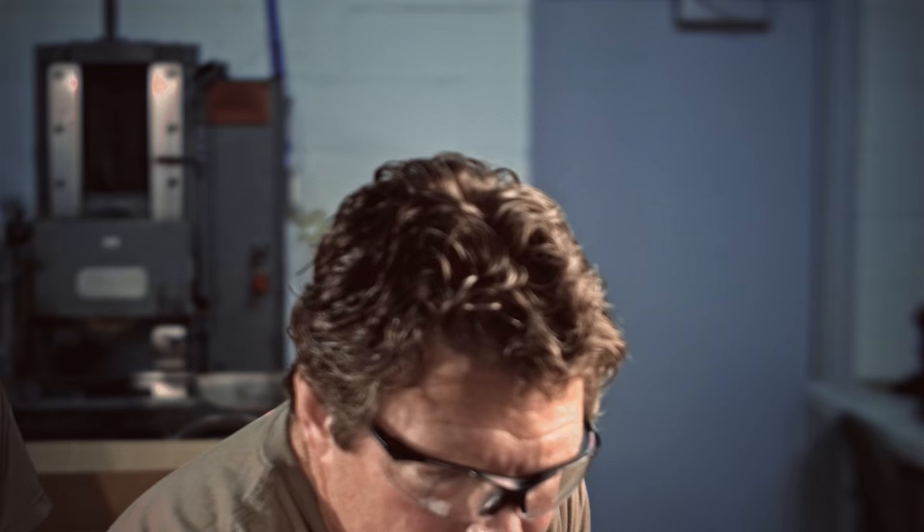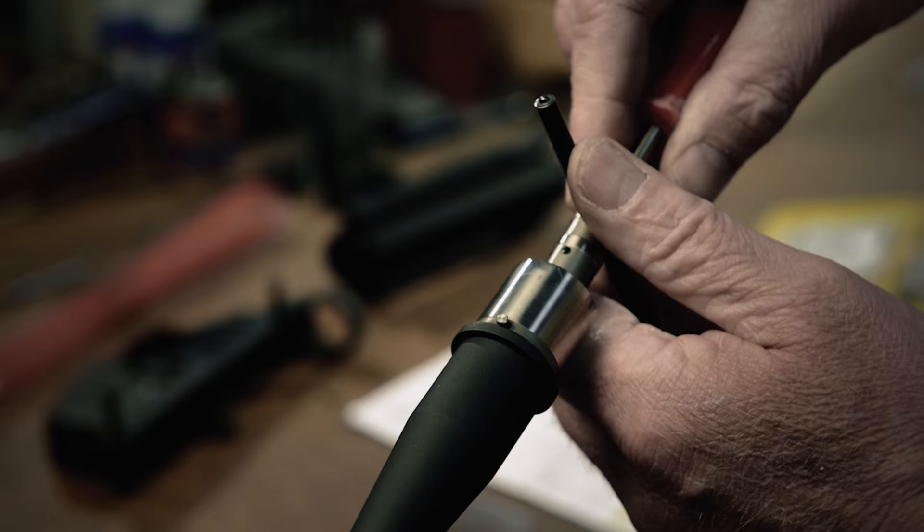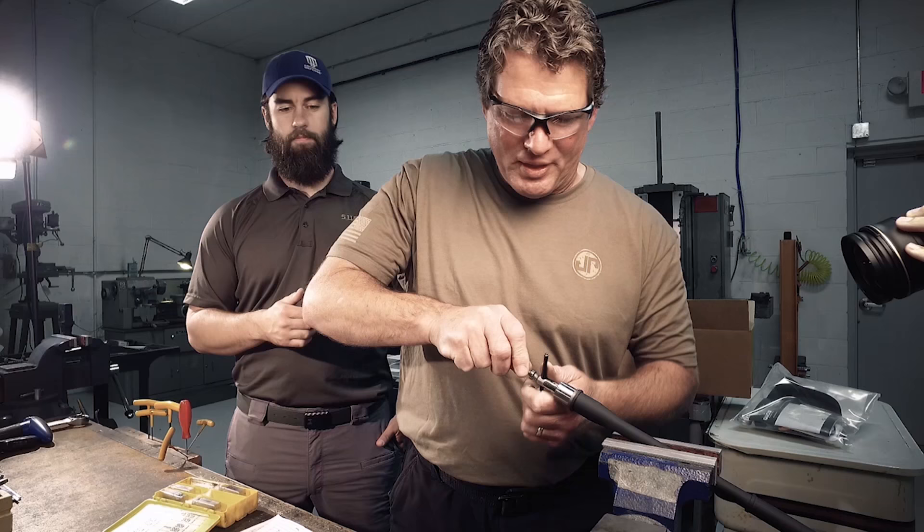Go plus two is the one we normally go with, and we'll feel from there whether that's good or not. What are you feeling for right now? Basically how tight the bolt fits in this particular chamber. Each chamber can be a little bit different — we don't control that, the barrel manufacturer does. But I've never had one that was out of spec, which is a good thing.